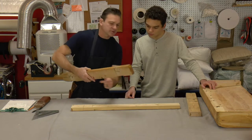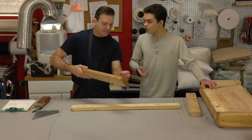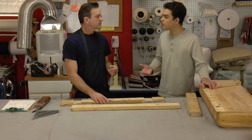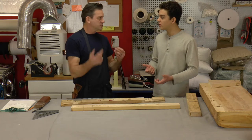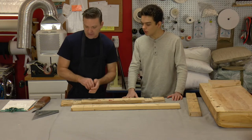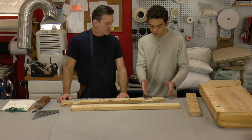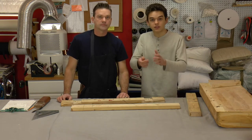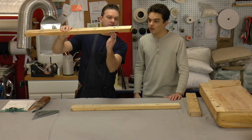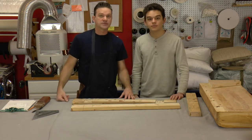After making the groove, we're going to drill a hole right in the center, just as the factory did, to receive the t-nut. The t-nut actually gets pulled deeper into the wood when you use the bolt on the other side. We got the depth by laying it on the table with the groove inside and raising the blade until it reaches. All right, you're going to see me do this on the table saw right now.